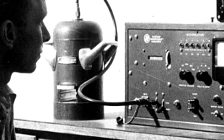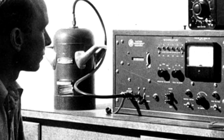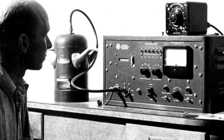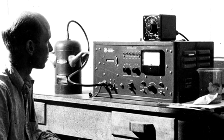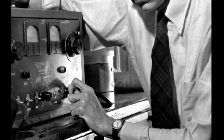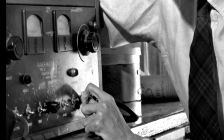Now, of course, that ionizing radiation may ionize a few atoms, but here's the real key — you get an amplification, and you get a cascade. You get one electron which is now loose from its atom, and it starts moving very fast towards the wire, so fast that it itself becomes ionizing radiation. When it bumps into another air molecule, it will knock an electron or two off of it. Now you have two, and they get accelerated, and they bump into another, and you get more and more.